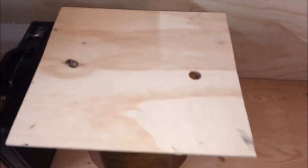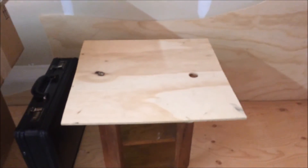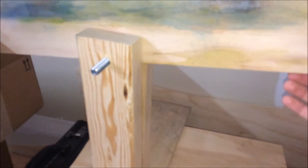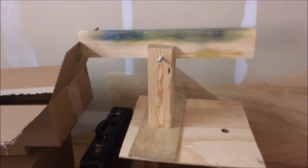There's a piece of plywood sitting on top of the wind tunnel with a big hole where a dowel goes in. The dowel would attach to the airfoil we were testing. On the other side of the chamber we had another piece of wood sitting on a scale. We'd zero it out with the wind tunnel off, then turn the tunnel on. As airflow started going and generating lift, it would push up on one side and down on the other, and whatever we read on the scale was how much lift was being produced.